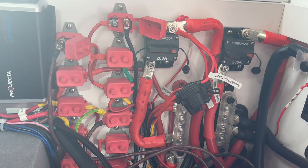This part I'm filming now is actually post a trip. With the new Victron unit on there we were able to run the air conditioner during the day, and we're getting 47 to 50 amps of charge current back into the system. So yeah, I would run it for quite a few hours, giving us the confidence that it'll charge back up the next day anyway.